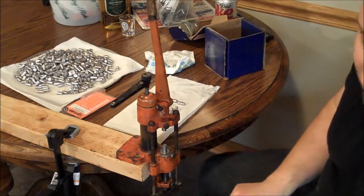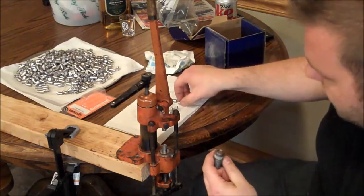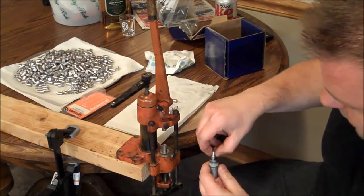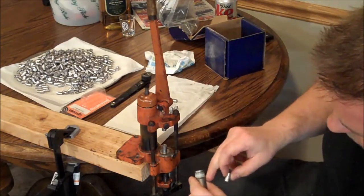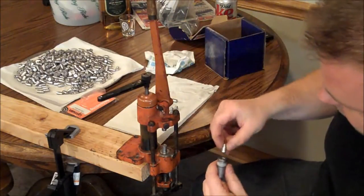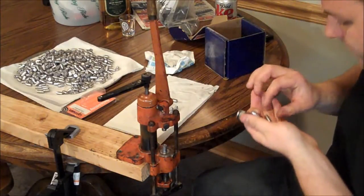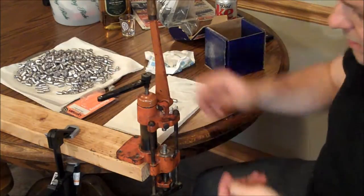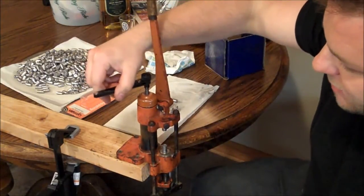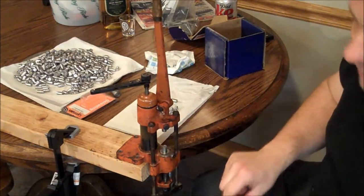It actually works pretty good. I've tried it and it seems to really stop leading. What you do is put your unsized bullet in here and the ram pushes it down to where there are some holes. Then you turn this top lever and it causes grease to pump in, then you lift it out. You can put some tension on this and build up a little pressure, because the ram keeps the grease from spraying until there's a bullet down there.